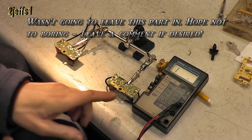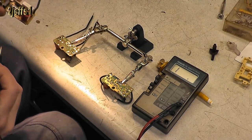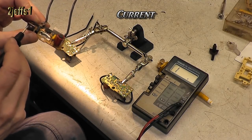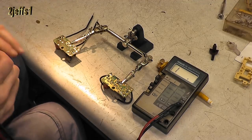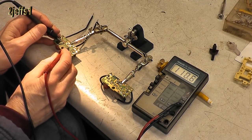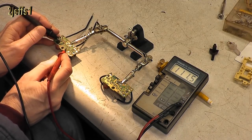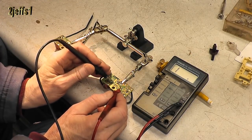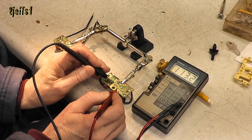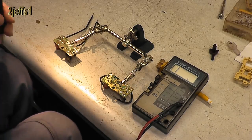Okay, here's our new board. This is the one with an issue. I'll show you what I'm going to be looking at. Let's measure the value of this low voltage which varies the resistance to trigger the high voltage for the rheostat. These are these two pins here — 18 and 11. This one, maybe 109. 12. Not too far off. I think we should be looking elsewhere.